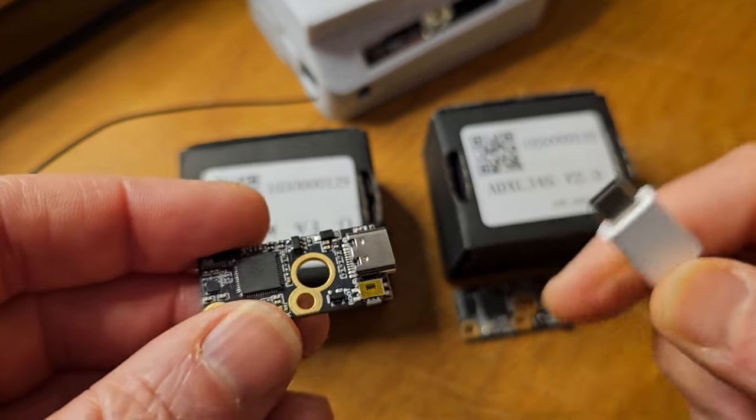Now we can run our test. It puts the machine into position, and as you can see it starts shaking the system. It's going to shake the heck out of your machine. Back on screen you can see it's running through several increments of different Hertz — the frequency is steadily rising up. Depending on how your machine is mounted, you'll start hearing the frequencies once they get into the audible range.